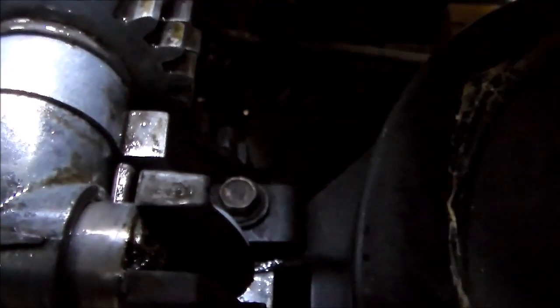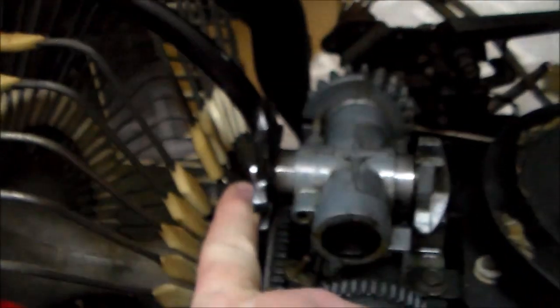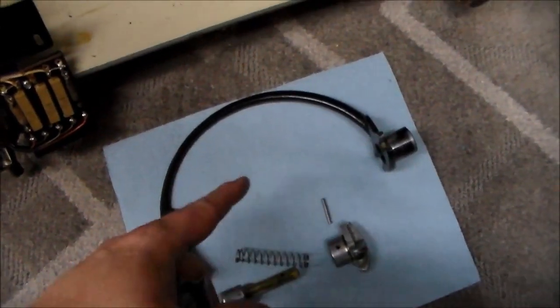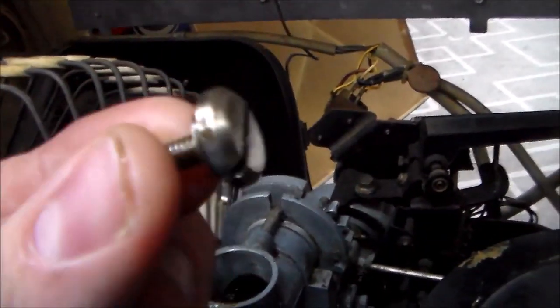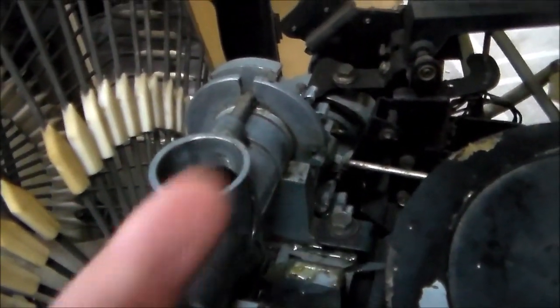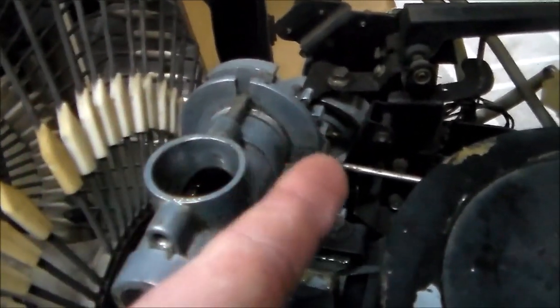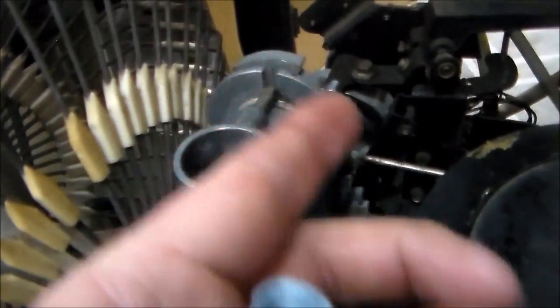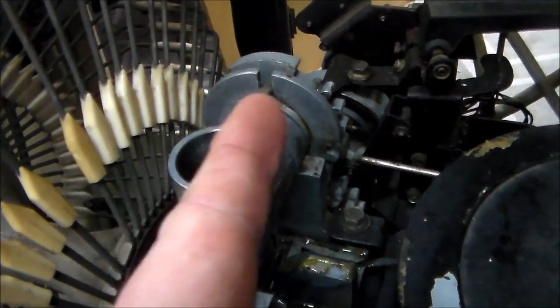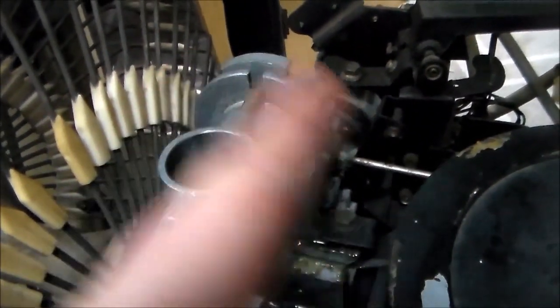I used a little tiny screwdriver and tapped it with a mallet so the pin is now sticking out the back. I pulled that out, which let this piece and this piece come loose. Once the pin's out, the gripper bar bow comes out, and you're down to the main shaft assembly. There was a little screw on the back holding a piece on. The black sleeve inside has those gears on it, but you can't take them off with the gripper bow down because the gears are meshed with the gear underneath. You have to keep track of how everything lines up so you don't get the gear in the wrong spot when reassembling.